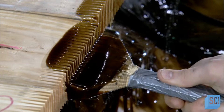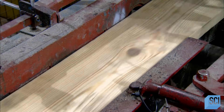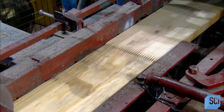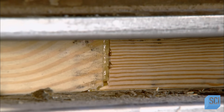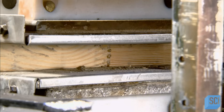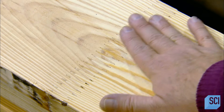The glue is high-strength and waterproof — it goes on brown but dries translucent. Workers line up the glued boards in a machine called a crowder. The machine's pressure rollers slide one board into the other, interlocking the finger joints. Then two plates clamp down on each joint, rendering the adjoining boards flush should one be sitting slightly higher than the next. About 15 seconds of heat cures the glue. The connection is barely visible because the glue dries translucent.